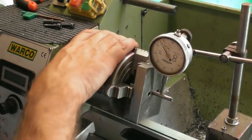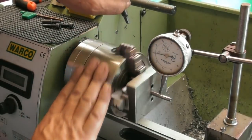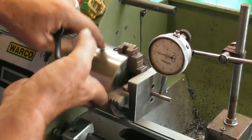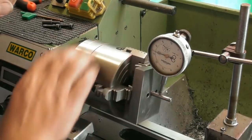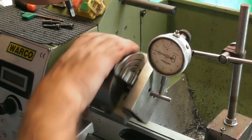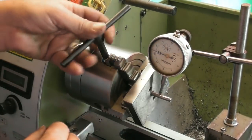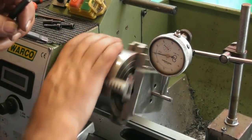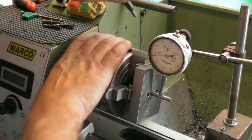Right, so wind it round. Where's the high point? There. It's very loose at the moment. Tighten up on the high point. Go round to the low point. Just give that a little bit less. Back to the high point. Should be getting somewhere near now. High point there. High point on these two. Starting to just crush that aluminium into shape now. High point. Low point.